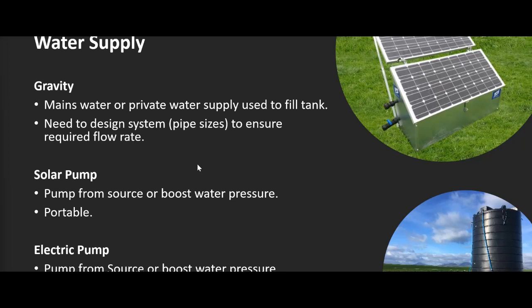Solar pumps are really exciting. They're produced by two or three manufacturers from the UK or Ireland, with a lot of product available off the shelf. They pump from an open source — like a river or pond — or even from a well or borehole, supplying a really good distance. Capacity and specification have improved a lot in the last couple of years. These standalone solar-powered units supply up to 15,000 litres and can pump up to 50 or even 80 metres head. They've transformed grazing on many farms, particularly on rented blocks where capital investment wasn't permitted.